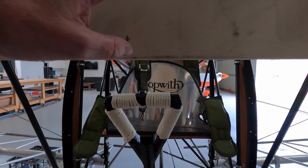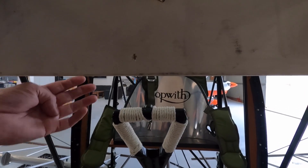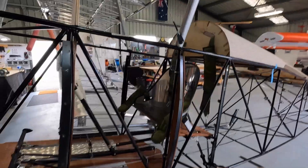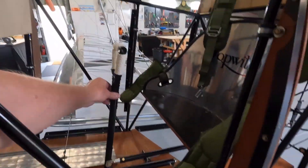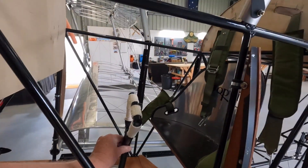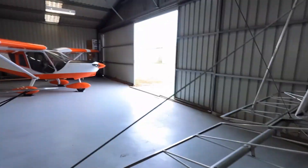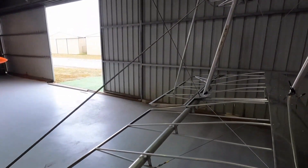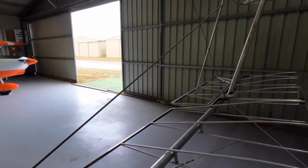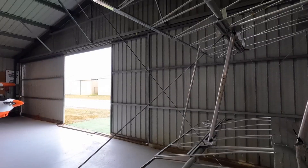The reason I made it short like that was because of the dashboard. What I now know is the dashboard comes back here, contrary to what the plans say — it puts it forward 28 inches. You see how this stuff all sort of snowballs. Also, when the elevator is neutral, that should be square — so I'm only getting a certain amount of elevator travel. I need to contact my friends who are flying these and find out how much travel they have.